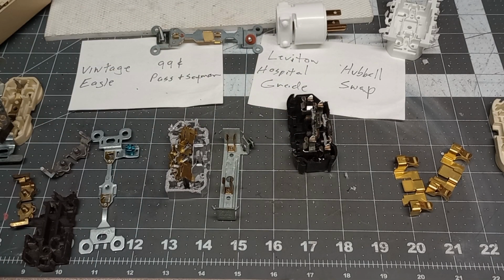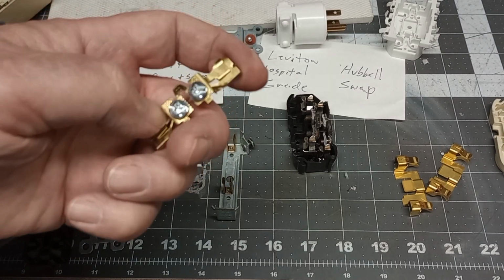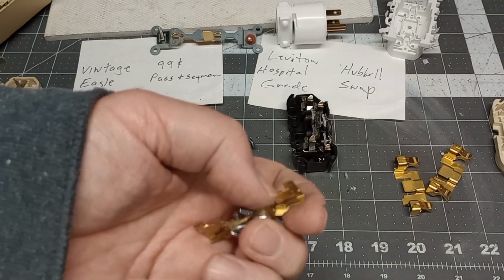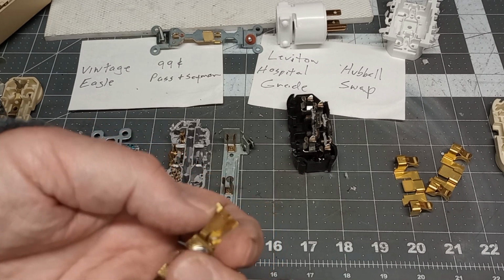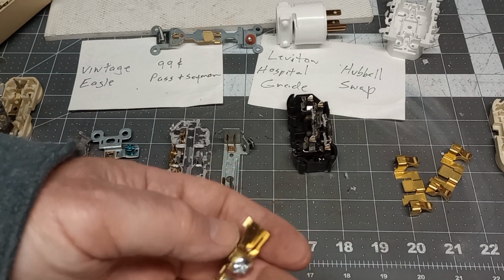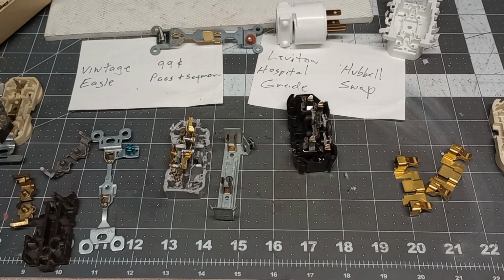I've seen the commercial spec grade Hubbells and the hospital grade seem to be pretty dang closely made. And like I said, there's the difference. Kind of a difference there. So, I don't know, make what you make of it, but with a cheaper outlet, you're not going to have as good ground retention. And again, I don't like these